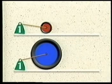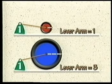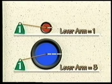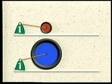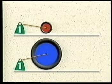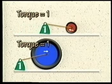The things we learned about how torque and speed work with gears can also be applied to wheels. A wheel also has a rim force and a lever arm that corresponds to its radius, and the torque in its axle is measured by multiplying the rim force by the lever arm. Here we see two wheels, one three times larger than the other. Both wheels will drag equal-sized weights, and both are connected to gear trains which equally apply one unit of torque to the axle of each wheel.